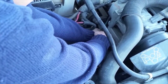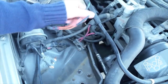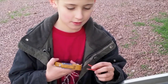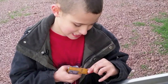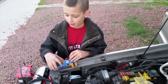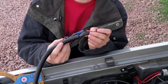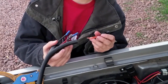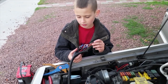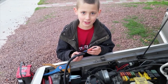Now we're going to strip the backs of the wires, and we're going to crimp them with the red and the black wires that came in the wire loom — that would be here and here. It doesn't matter which wire goes to which end. Before you do, don't forget your heat shrink.